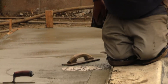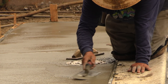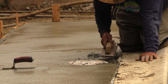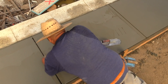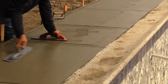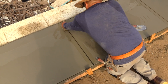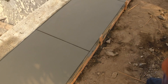Right here you can see the finishing work. These guys are going through and putting the finish on the concrete and also doing the edging — going around and putting the edge on the concrete as well. These are very skilled tradesmen. You saw these guys working in three and four man teams. They're using chrome-plated finishing trowels, wood floats, and brass edging tools. They're doing this to sharpen up the expansion joints. You can see some nice sharp expansion joints going all the way around the pool.